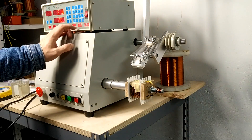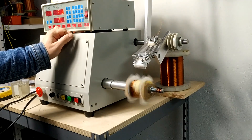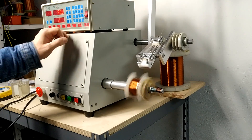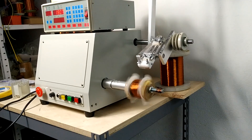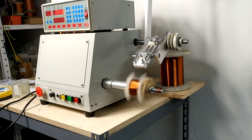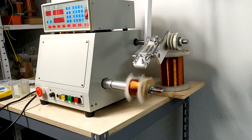It fits just perfectly in one layer, which is nice. I've changed the wire gauge again, reset the machine and now I'm winding the second part of the primary winding. The nice thing about SE output transformers is that you don't have to worry about the balance between primary windings, as in push-pull, since it will all be just one winding connected in series in the end. That makes it really practical for interleaving.